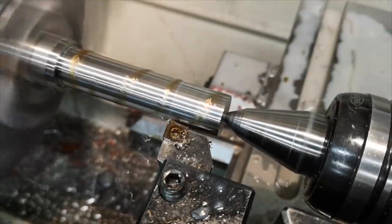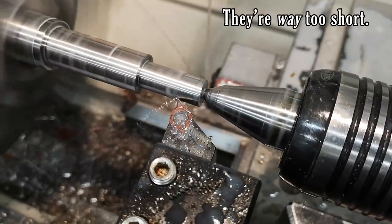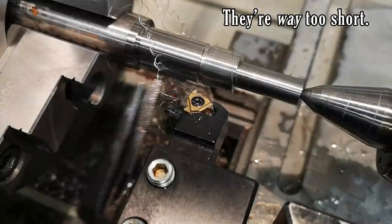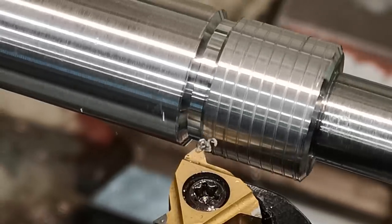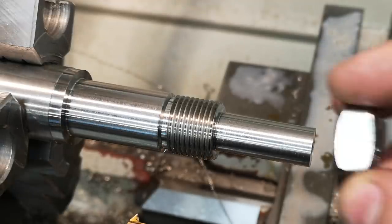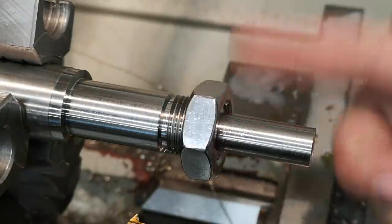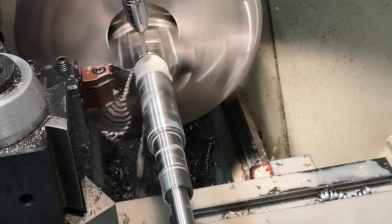There are two major flaws that I'm a little worried about with the injection molding machine at the moment. The first is that the screw and barrel are a little bit too short, so it's going to be pretty difficult to isolate all that heat to just that small volume. The other big problem is that it's actually pretty difficult to make the screw, especially on manual machines. There's not much distance between the extruder heat source and the rest of the machine, and most of that distance is through aluminum, which is basically a really good conductor of heat. The first few parts might be great, but after a while the entire machine might be 200 Celsius and the electronics might have melted. There's also no water cooling, although fortunately there's a little bit of space to add some.